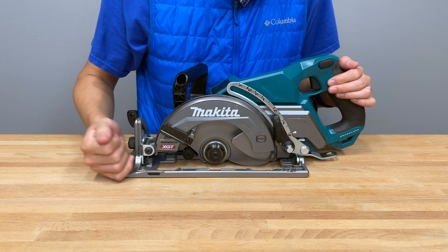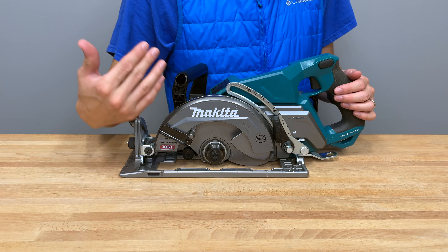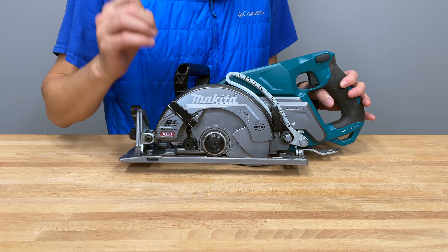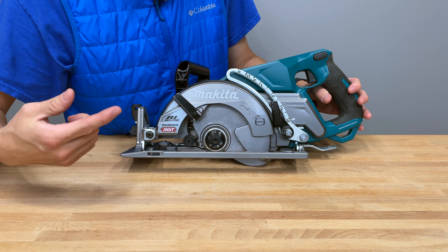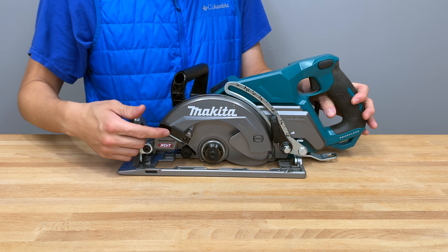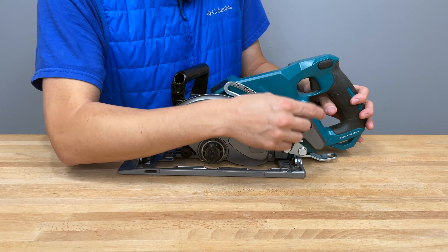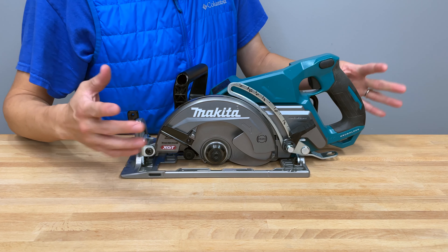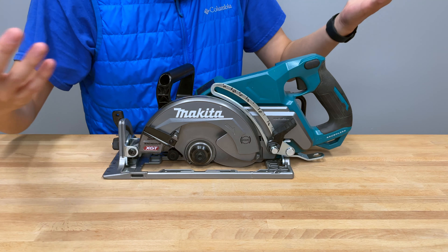This is the business end of the saw. If you're right-handed, this is going to be the left part — worm drive style saws are typically blade left. The base is magnesium, a slightly darker shade of gray than the LXT stuff, making them easy to tell apart. The blade guard lever is not rubber over-molded — it's standard metal — but the depth guide adjustment knob is rubber over-molded, which is a little inconsistent. On the LXT model, it did pretty much the same thing.